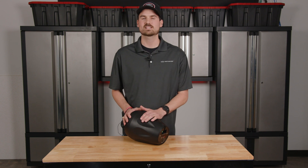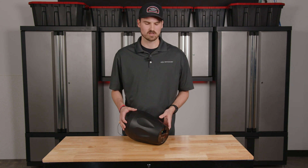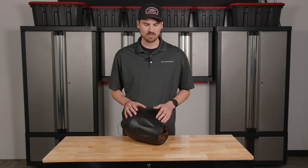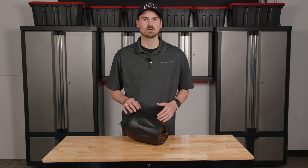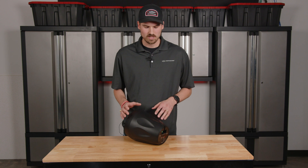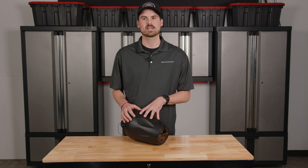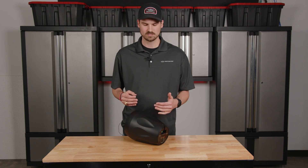Using the 87 dB sensitivity for the PD6 as a reference — as you double the power, double the wattage, you gain 3 dB. With a 32-watt tap setting available, you can see how that output gets higher each time you increase the tap setting. The kicker is that as you get further away from the speaker, you lose dB — and every time you double the distance, you lose 6 dB.